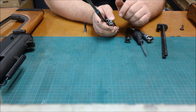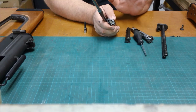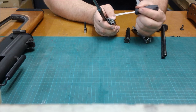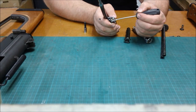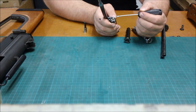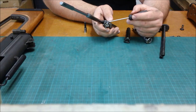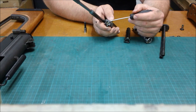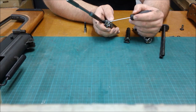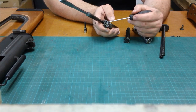Now imagine you have a regular AR-15 bolt and it's flat. All that debris would be pushed forward and form a little barrier of dirt and debris between the bolt face and the barrel shoulder where it actually locks up, possibly preventing proper closure of the bolt. This design allows that dirt and grime to be underneath, hence not preventing it from locking up, allowing it to fire under the harshest of conditions. You notice there are a couple of manufacturers nowadays making AR-15 bolts the exact same way.